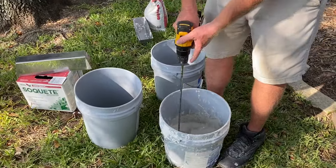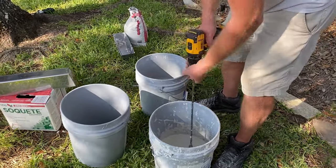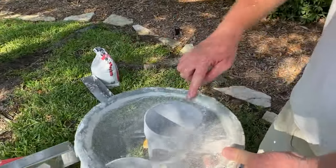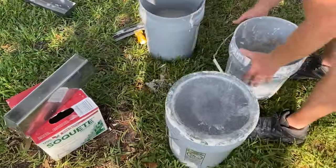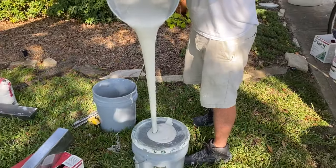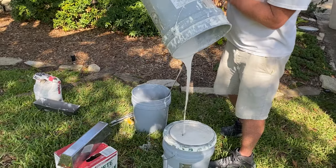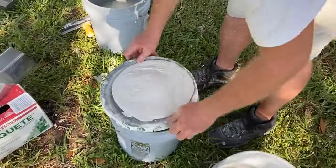This is really the key — to keep out trash. All mud dries and you get trash in it. So what I do is actually screen it. This is just a bucket top — I cut a hole in it and stapled some regular screen tube. Put that on the bucket, get up kind of high depending on how thick it is. As you can see, there are a bunch of chunks in there. This gets all of that out and gets it nice and smooth.